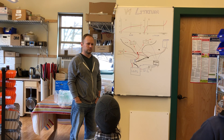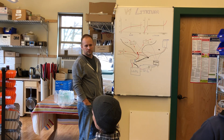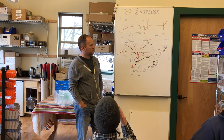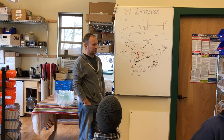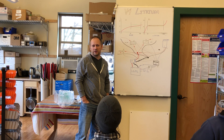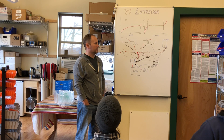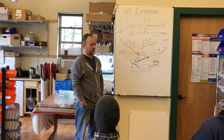Part of what makes Victron inverters great is that they can be custom-programmed internally to separately regulate charging versus load — you don't get that with a Magnum. With a Magnum, if it loses DC it's lights out: no load capability, no charge capability, no pass-through. One workaround with a Magnum is bypassing the cold disconnect so it can charge when freezing, but if you're tied to shore power you're unlikely to let your RV freeze anyway, so cold-charging with a Magnum is rarely an issue in practice.